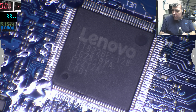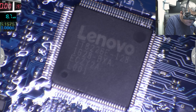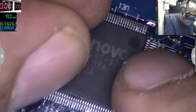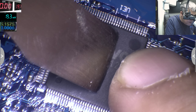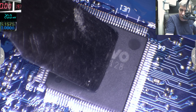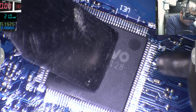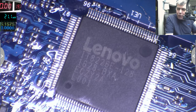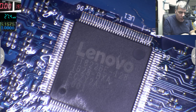I need a small nozzle. Air at 500 degrees, airflow 50% — that's good. What is important again: chip position. Chip position looks fine to me. Let's start.